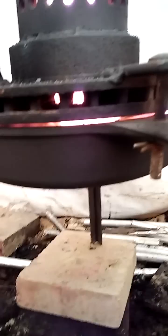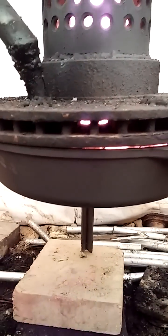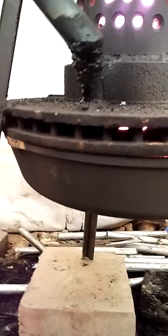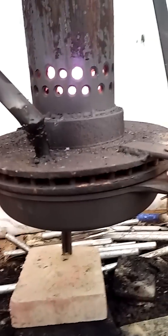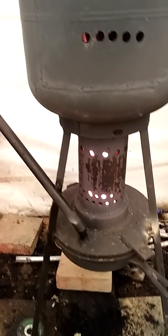There's just a slight gap between the rotor and the pan. You can see my three air holes in the front. It's better if you use non-vented rotors like the rear of a car — then you don't have to worry about blocking off the air holes, you can just drill a few holes in the top to add the initial airflow.